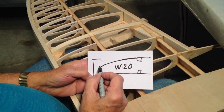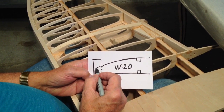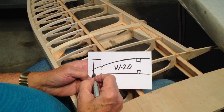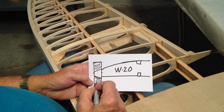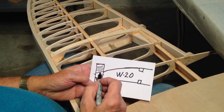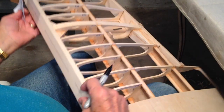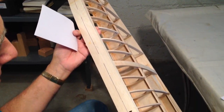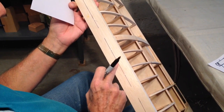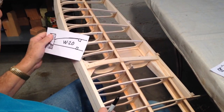I didn't draw this quite right, but the idea is the same. We're going to clip it off and plane it off just like that — all of this will be gone. This line on the leading edge right here represents the center. That's your datum line, and that's also the chord line of the airfoil.